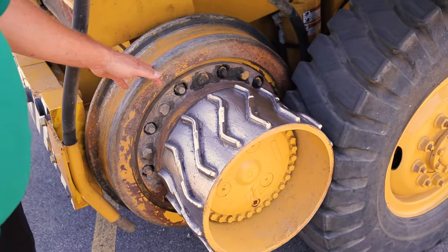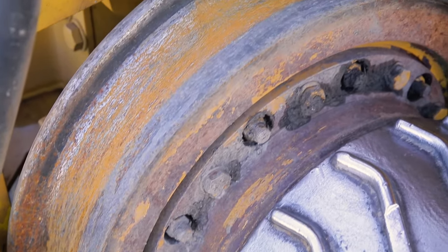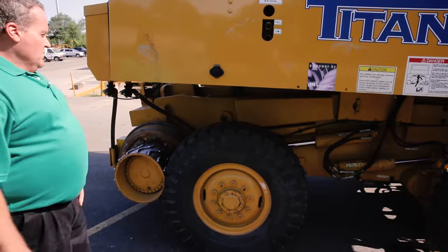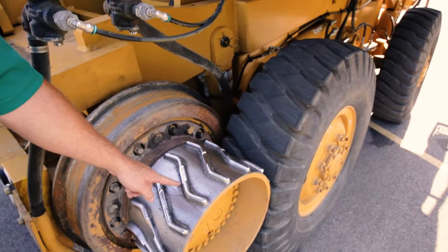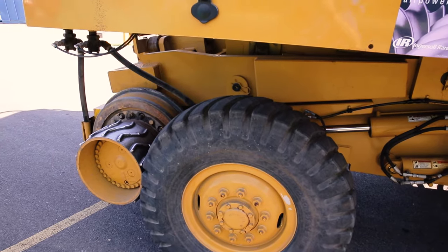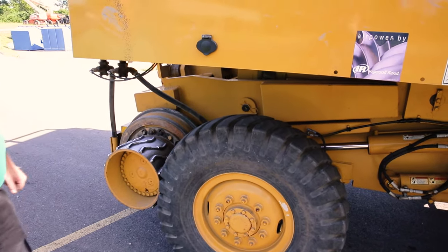One of our big features is we're a steel-on-steel drive machine. We use our steel rail wheels to drive on the rail versus alternate methods. We use our rubber tire drive only to drive on the road — we engage our drive hub into our rubber tire for road applications only. We can use our steel drive hub to drive our rubber tires down the road, but other than that, our rubber tires are retracted. We're steel on steel the whole time we're moving rail cars.